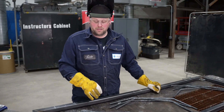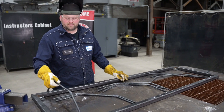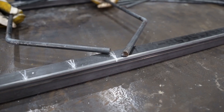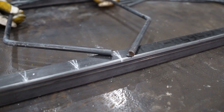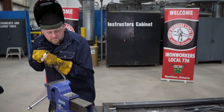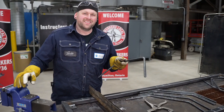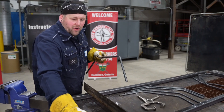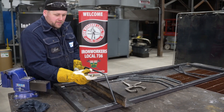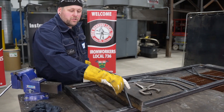Now that the frame is welded, we'll pack in our uprights. I noticed after I put my frame together that these just land on the outside of my frame — I want them to hit center. That's an easy fix. Since these have a 45 in them, it's going to be hard for me to run a square up to make sure these are actually running true. So I've grabbed a chunk of 3x3 angle and I'm just going to hold it to it while I tack. You could also use a clamp.